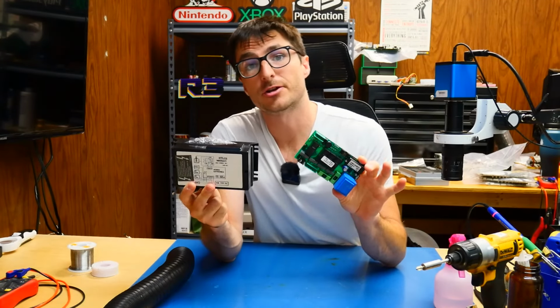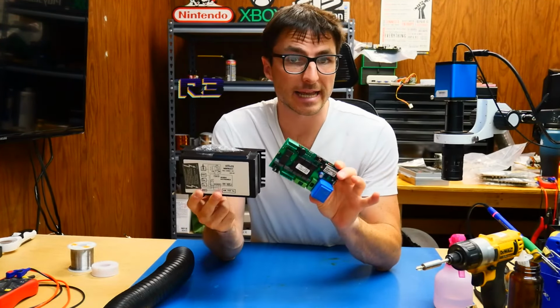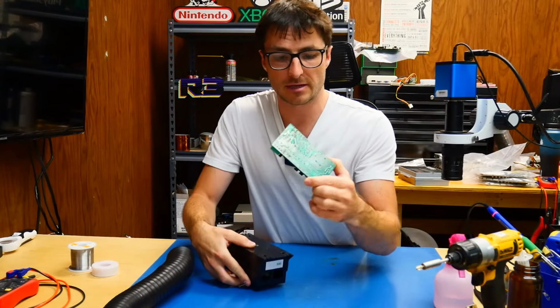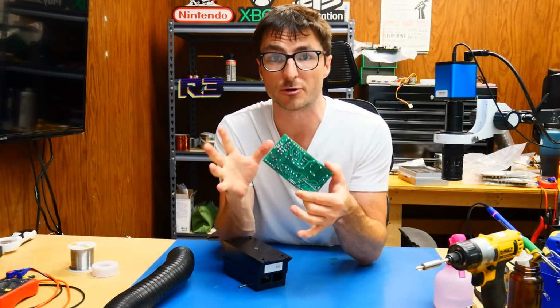A customer sent in their controller board for an espresso machine. The issue they were experiencing is that the heating element failed, caused a power overdraw and some arcing, which did damage the controller board. Now there is some damage on the back we're going to look over under the microscope and see what we need to do in order to fix it.